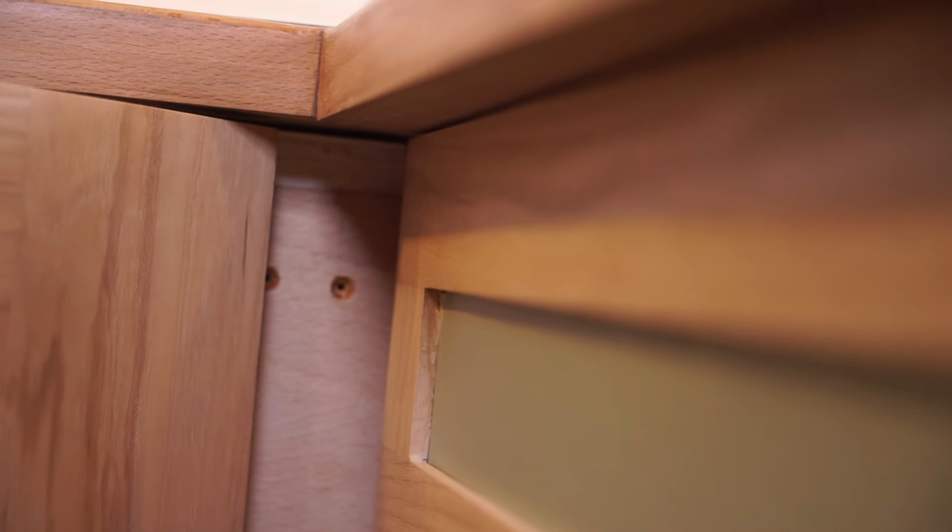If you look at that screw hole there, the one on the left-hand side, which is half covered, it barely kicks out. When the door's closed, from closed to open, it doesn't actually kick out much. And the problem was it was open before. So as long as I measure it in a closed position, then that is the furthest it kicks out.